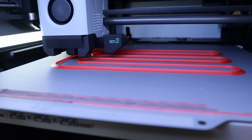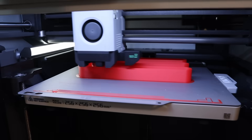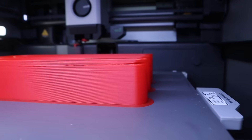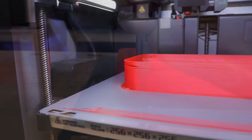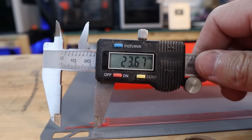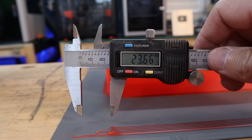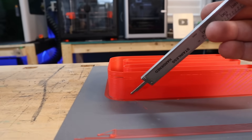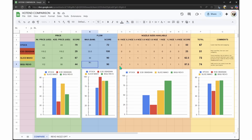The test runs from 25 millimeters cubed per second to 40 millimeters cubed per second. I have the identical spool of Basic PLA from my previous testing video, which has been pre-dried and is still in the dryer. We're at 23.67, so rounding up to 24. We times that by 0.5, which is 12, and we add it to the starting number of 25. So we're up around 37 — or 36 and three quarters — for max volumetric flow.